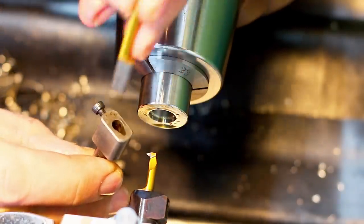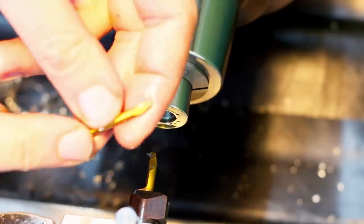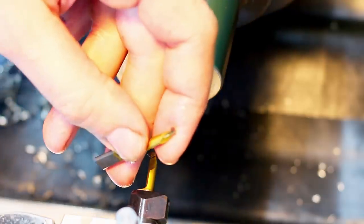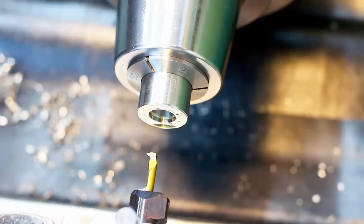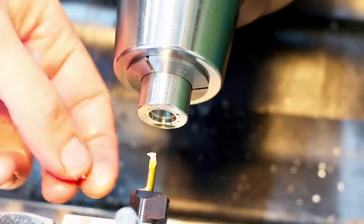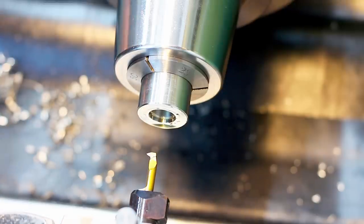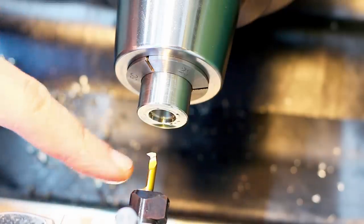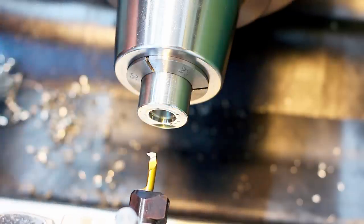So these are very approachable if you want to use these tools. And these Horn Super Mini 105 tools show up in used condition on eBay for very little money constantly. So you can buy a large batch of them for truly little money. And these are very, very easy to resharpen. With a fine diamond wheel, you can do a lot with these.